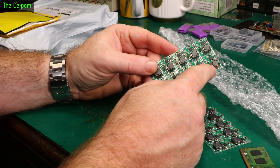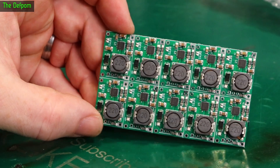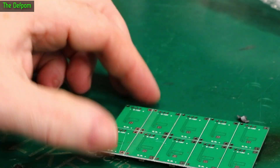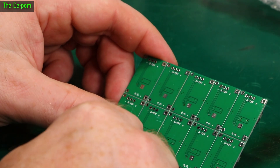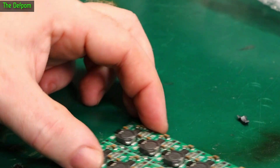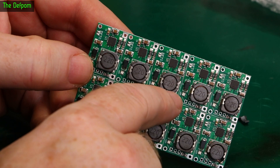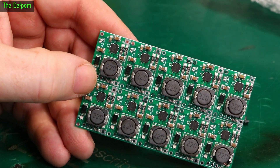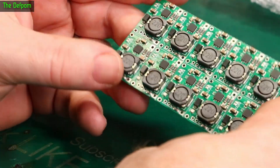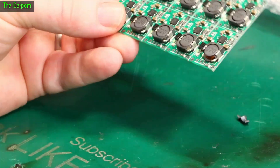One of them is broken - that's a shame, they're cheap though. These are little power supplies. I believe these are lithium charge controllers - 5 to 15 volts at one end, and that's battery positive/negative at the other end. It was selectable, and the voltage is settable - there was a resistor setup on it. I don't remember exactly how it was configured but I'm pretty sure these were lithium charge controllers, so you can use them to charge your lithium cells and configure them for however many cells you need.